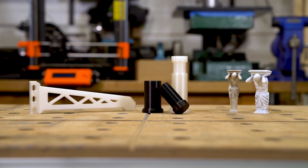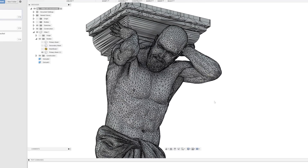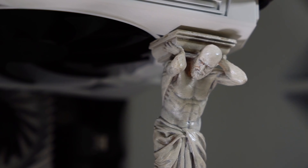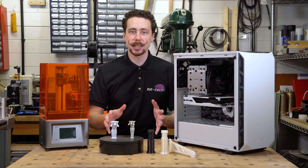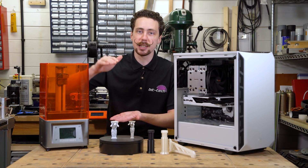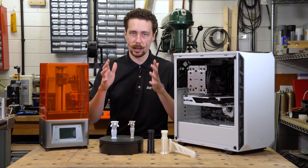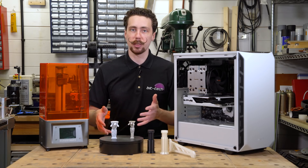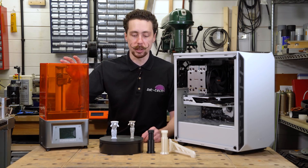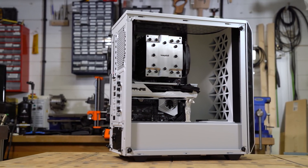As mentioned, I'm going to put all these models up for download on GrabCAD. The Atlas figure I can't share due to licensing, but I can put up the larger edited version since it's a royalty-free license and I've changed the file quite a bit. For the support height required in this mod it's 80 millimeters, but yours might be smaller or bigger — you can scale it very easily in the slicer software. This printer uses ChituBox where I can just set 80 millimeters print height and it does it automatically. I'd love to see what you guys come up with — link your projects on our Discord or in the comments.